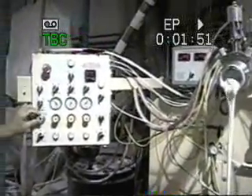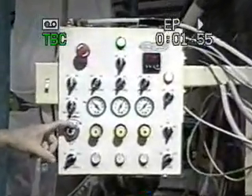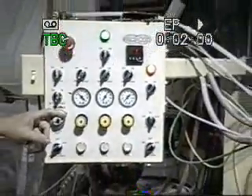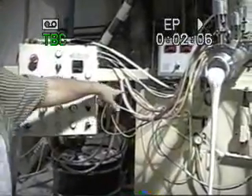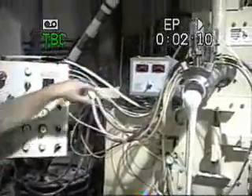At that point, you can make adjustments on your filler here where it says metering rate — you can adjust the viscosity of the resin and how much filler you want. Catalyst pressure and metering rates are up here at the top. Keep an eye on your temperature.